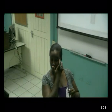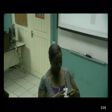I don't want you to crimp yet, because if you crimp it and it's not set properly, you will have to cut off the end, that entire part, and go through the process again. You can't reuse the ends. So do the same, make sure that you insert the wires with that clip facing up, and make sure that all the wires touch the end, the tip.